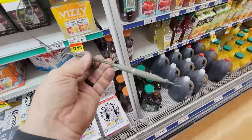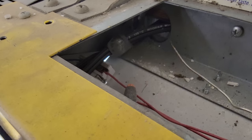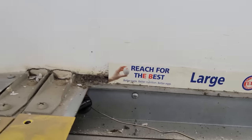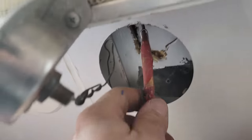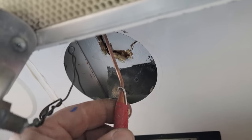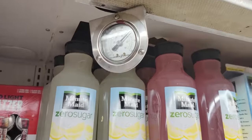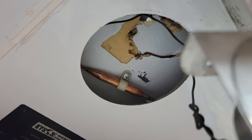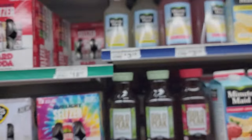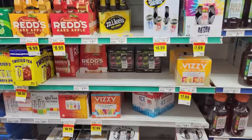That thing is silver — I've never seen a sensing bulb silver. That thing's two or three years old at least. I'm going to go ahead and chop that and pull it through with the bulb, tie it to it, and pull it into position. This is the biggest pain in the butt I've ever seen. I was able to hook the old wire on the back of that, tape it up really good, and pull it through. Total pain in the hind end.